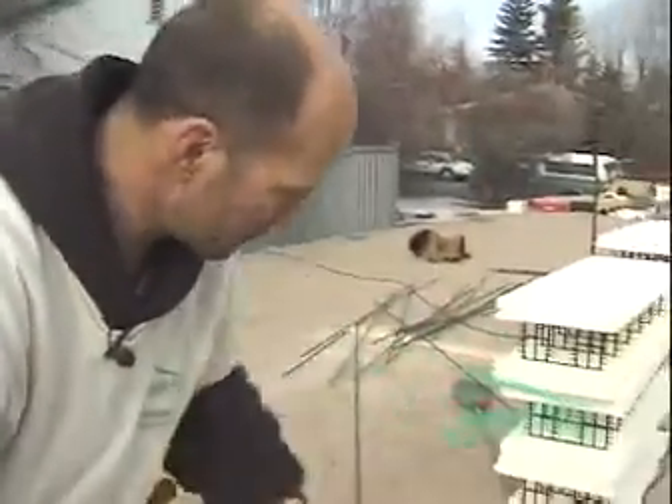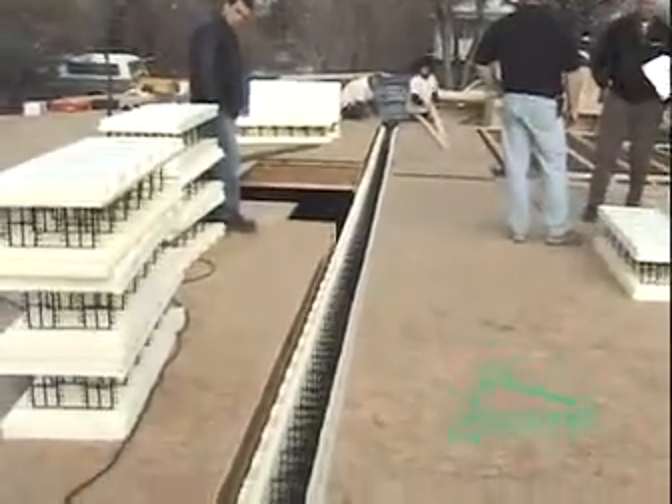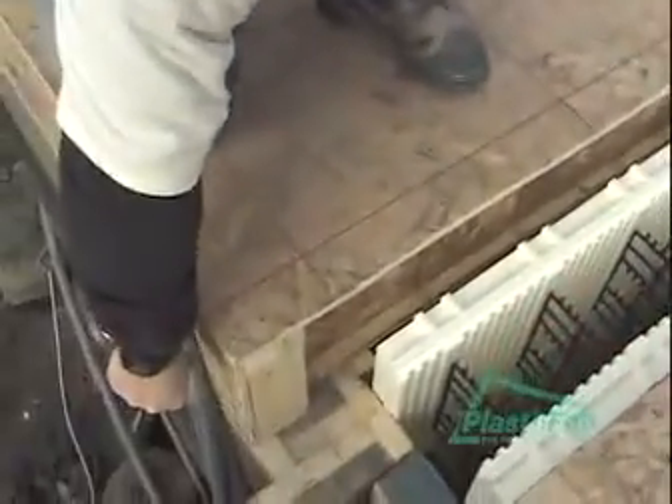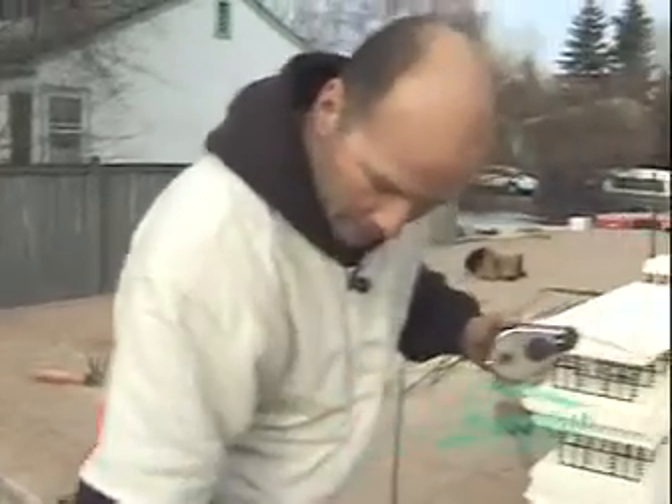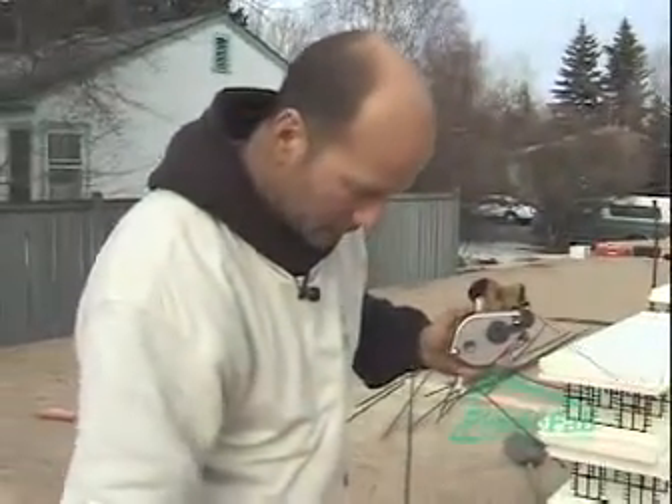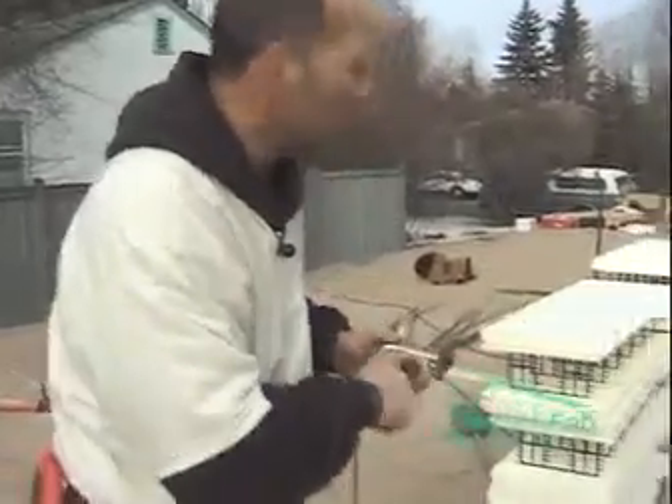What we're doing here is snapping our line at the top. We're going to lay a 2x4 sleeper on each side of the wall to sandwich it straight on line. So we're snapping a line at outside a 2x4, then we'll nail this 2x4 down and set our next roll block and away we go.